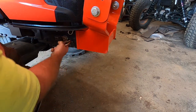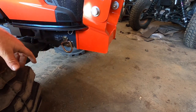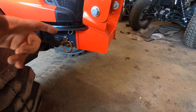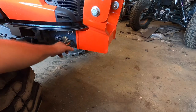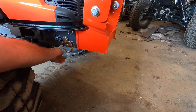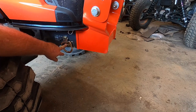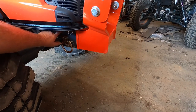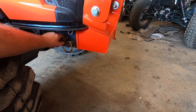That's all tightened down. I put half-inch bolts in it — they're about an inch and a half to two inches long. I've got a lock washer on the back with the nut and it stops flush with the nut so it doesn't stick out very far. It's a really nice setup. Just measure your frame and see how thick you need. On an open station tractor you might hear a little jingling, but on a cab tractor you're not going to hear anything at all. For a nice quick easy tie-down — I've seen some people use eye bolts, but I kind of like having two bolts. Yes, you have to drill a hole in your frame, but it's not that big a deal. Take your time, make it right, and it works pretty good.